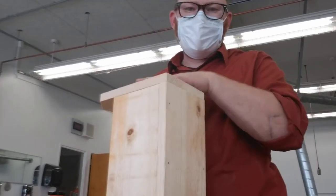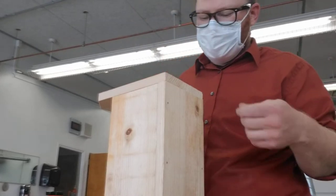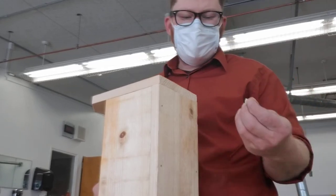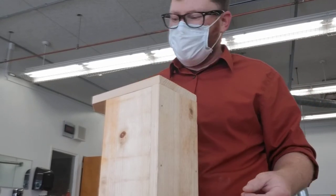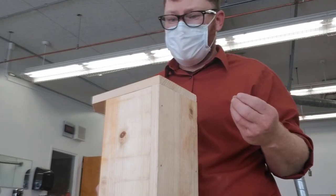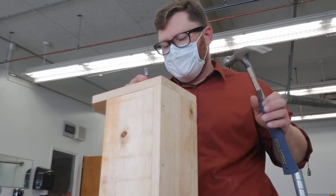You could do the ones on the ends and putty them over. If you've got putty you could take sawdust and mix it with glue and use that as a filler. These hand tools usually give us more chips than sawdust, so it's not going to be very good putty. The sanding process — when you sand everything you can collect all that fine dust from sanding and use that to make your putty.